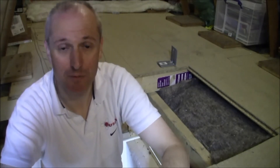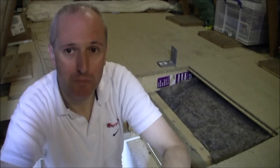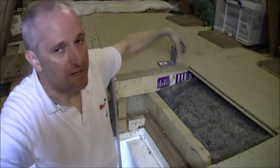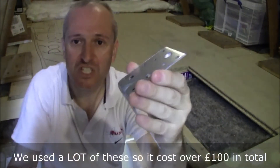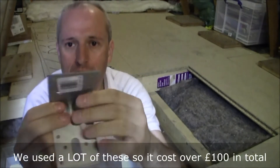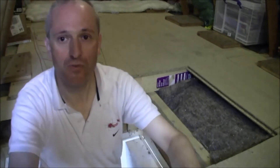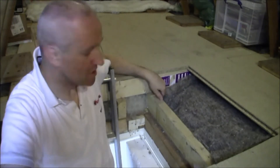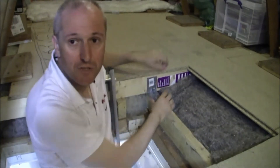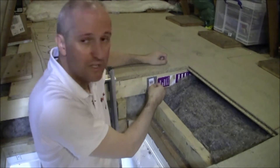You just can't lay pieces of wood across your attic and expect it to be stable — as we floored on top, it would just fall over. So everything has to be bolted down. At Wickes, we bought roofing brackets. They are steel, cheap to buy — we bought a bucket full of them. When you fix the first layer of wood across the joisting, you fix the two together, drill two holes here and two holes there, and put screws in.